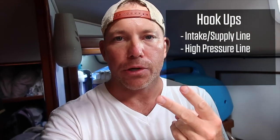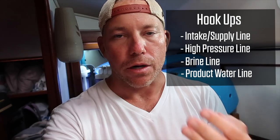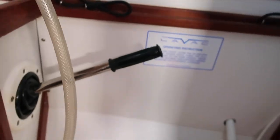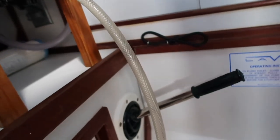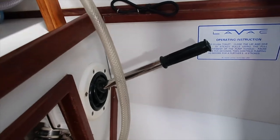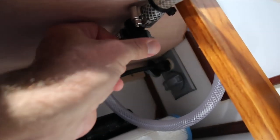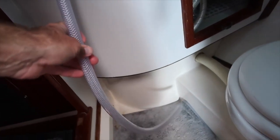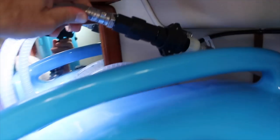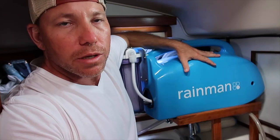Walking through all the plumbing — there are pretty much four hoses involved: the intake hose, the high-pressure hose that connects the pressure unit to the membranes, the brine (waste water), and the product water that goes into the tank. For the intake hose, behind this panel I've teed into the rinse water supply line. I have backflow preventers so things can only go the way I want. It feeds down and up into what I consider a homemade Y-valve — I didn't have a Y available, so I used two quarter-turn valves: one going to sea water and the other opening a hose for rinse water into a bucket.